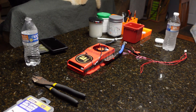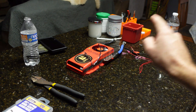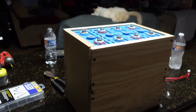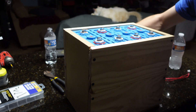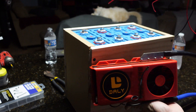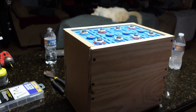What's up guys, Mike Builds here. We're back with our AliExpress battery. We're going to slap the battery up here, get the BMS put on, get the balancing cable put on, and hook up the Bluetooth to see if it works. Our AliExpress cells are top balanced, so now we're going to hook up the BMS. We're using a DALY 200 amp / 250 amp BMS. We got the balance cable right here — just have to crimp on the little ends, then screw the BMS to the side of the box, wire it all up, hot glue the Bluetooth dongle on there, and hook up to the phone to make sure it works.